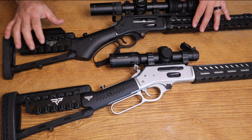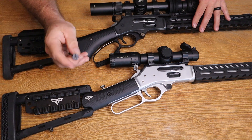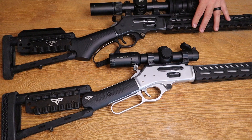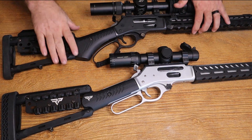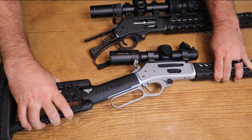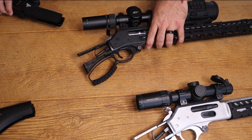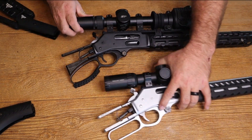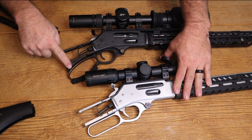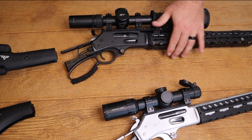So what if we do order the incorrect one? Let's remove our quick takedown screws — we've got a nitride and a stainless here. I like those because we don't have to use any tools. Let's go ahead and remove our pistol grip and our straight grip. You can see right here our lower tang is just straight on the straight grip, and our lower tang here has got a big curve — that is the trigger guard plate.